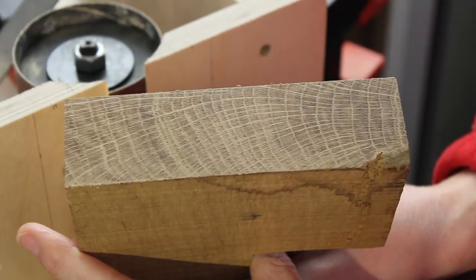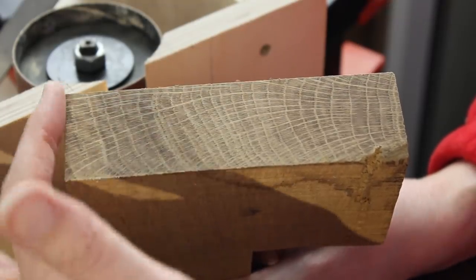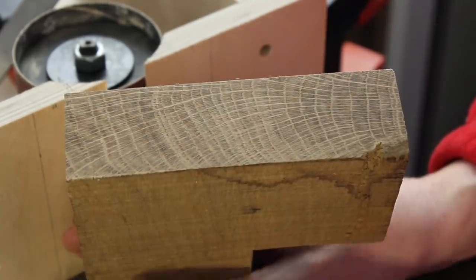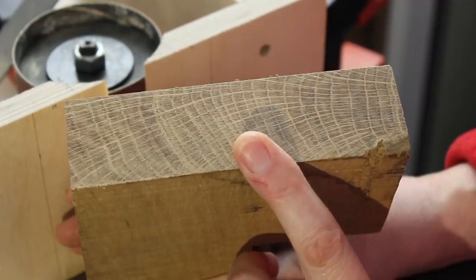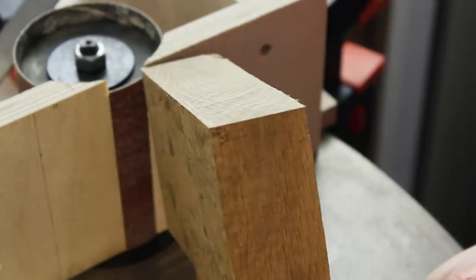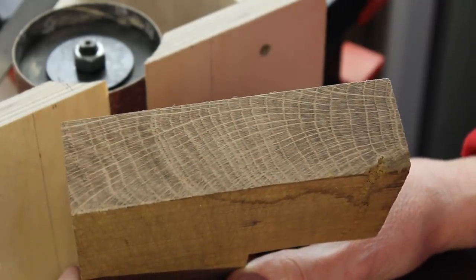Your plane would have to be exceptionally sharp. And I reckon you'd have to sharpen it a couple of times doing that. Plus, no tear out at the ends at all. Cross-grain oak, don't forget. I haven't done this little end here, but then I'd probably cut that off anyway. Despite my scepticism to begin with, I think I'd be happy to use that for jointing. That is a remarkably even, flat, square surface. I'm frankly astonished and rather happy.